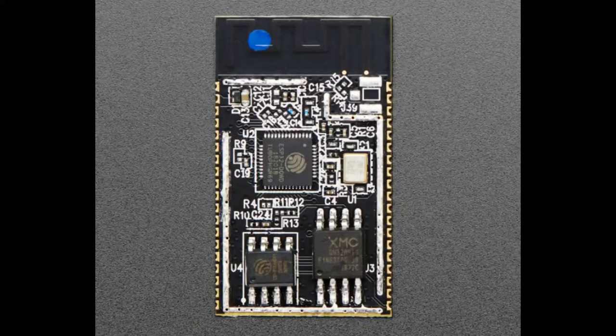But for smaller chips, like the ESP32, which only has 44, 56, maybe 64 GPIO, you can't dedicate 32 pins to SRAM and flash memory. Like the RP2040, the ESP32 doesn't have built-in flash, or has very little — maybe some ROM — and only about 300K of onboard SRAM. If you want to use the ESP32 to read large buffers or use TLS for encryption, you'll quickly run out of the 320 kilobytes. You really need a megabyte or two to read camera images, buffer a display, hold fonts, handle JSON data for internet connectivity or protobufs. If you're doing these kinds of IoT projects, you're going to need PSRAM.